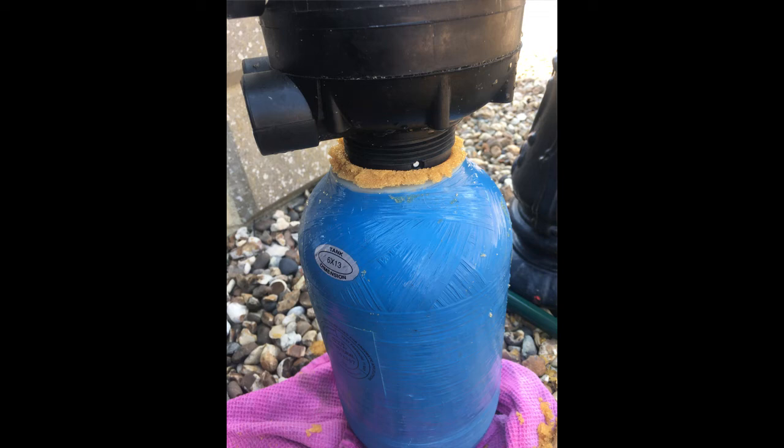It's sometimes a good idea to put a little bit of silicone grease on the large O-ring just underneath the head. You'll see where it seats down, it's on like a flange, but make sure you don't have too much grease, and be careful that you don't trap resin on the seal. So give it a good clean as you go in, keep wiping it off, or keep using an airline to blow it away, and you'll find that once you've pinched up the O-ring, once it's gone in there, don't force anything, because it's all supposed to work.